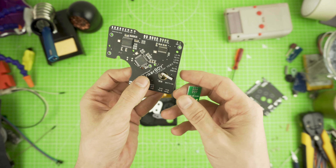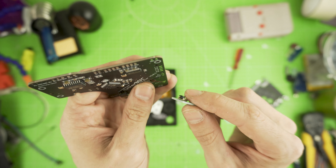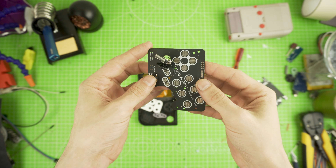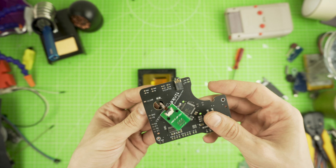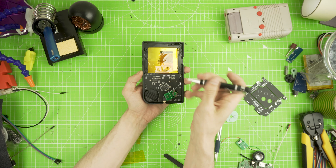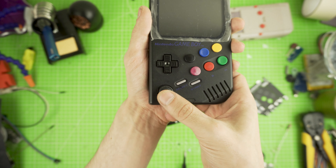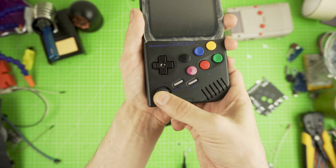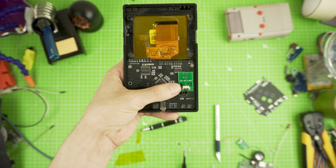We need to mount the joystick now so we can mount the bottom PCB inside the case. Slide the ribbon cable through the hole, or better, have it coming from the side of the case. Just pop it in place carefully and we are ready to screw the PCB down. The joystick is held in place just by pressure, but it's good to have a dab of glue so it stays there. Once done, it should look something like this. The helping PCB will come nicely on the side of the bottom board.